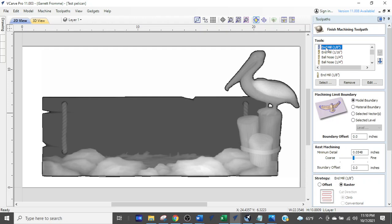Still scrolling all the way down to ball nose 1/32. We don't want all those. The software is calculating tool paths for every single bit in there, even duplicate bits. We want to start removing them — keeping an 1/8, a 1/16, and a 1/4, starting at the largest bit and going to the smallest. So why did this person get so many in here?